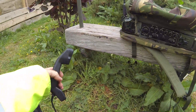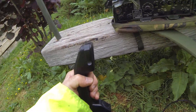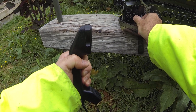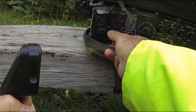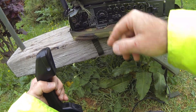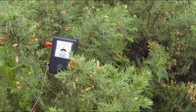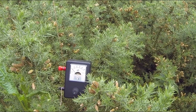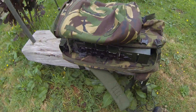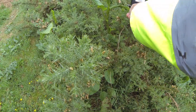Let's now put the counterpoise on. We've got the counterpoise on now onto the set. Let's see what sort of tune we get. That's made a difference there already. Back to low power - there's a little something there but not great. Let's go back to high power, 25-30 watts. That's full scope - what a difference! So I can tune that around a bit and turn that down.